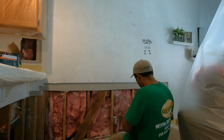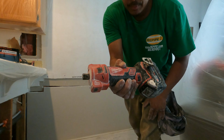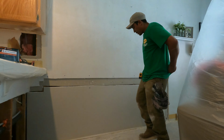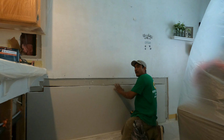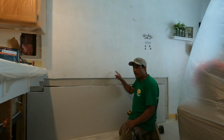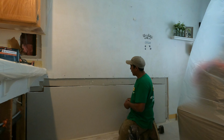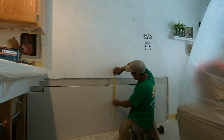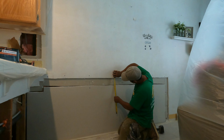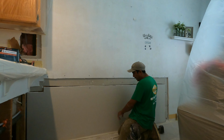And this is the measurement for the outlet. I'm going to make a mark to know where it is, and the outlet I cut with this router. Remember, when it's double drywall, the box is sticking out a lot because it has to cover the two layers. So the first layer maybe is not going to come out alright, but we work around.